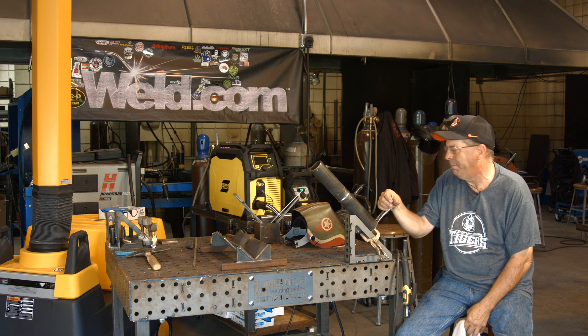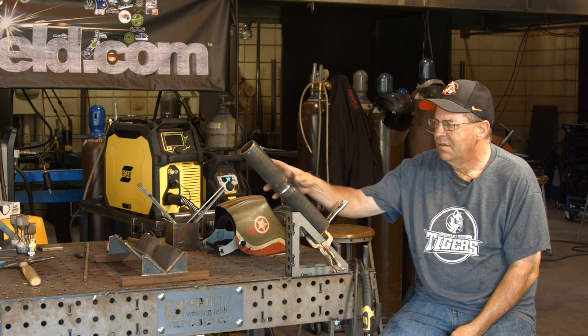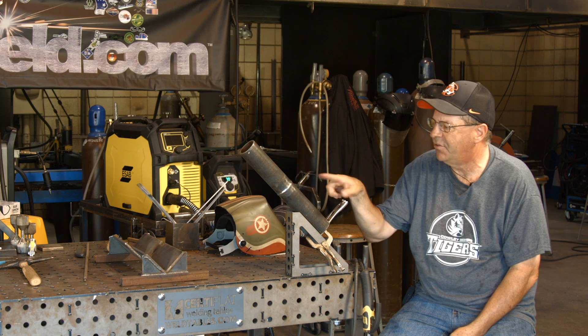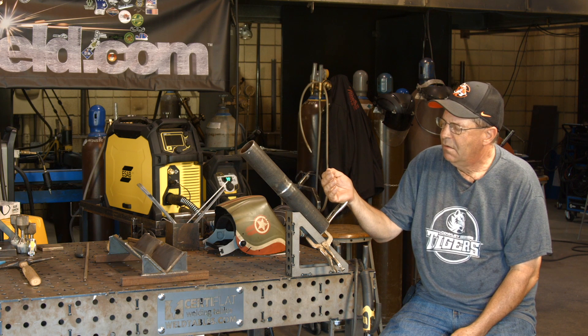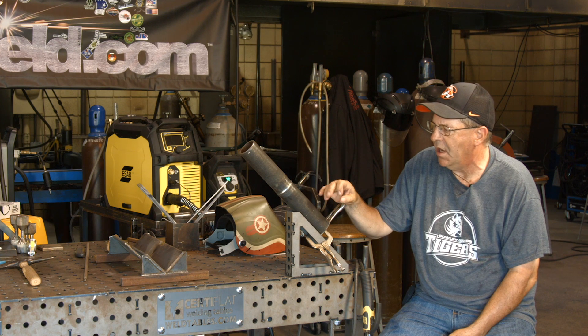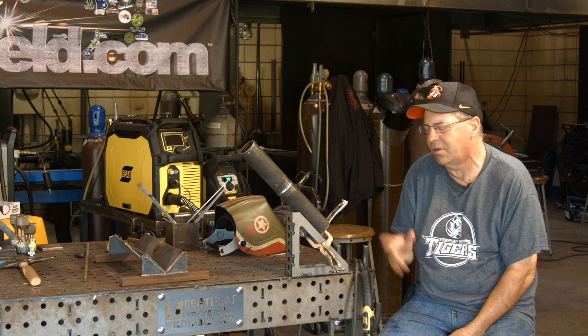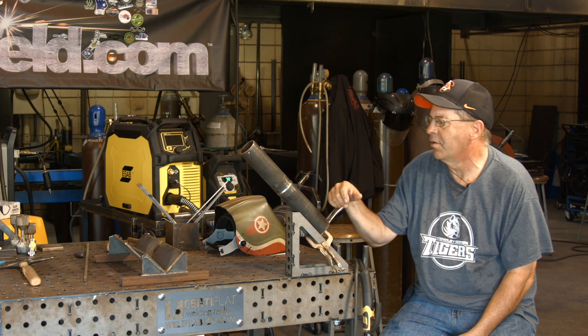On the cap, I just went straight to cap and turned it down to 70 amps. You may think that's a little low, but 70 amps on 3/32 7018 — this part is saturating with heat quickly. If I had a little bit fuller fill I probably could have gotten away with a single bead. However, I had a little bit to fill, so I opted to go 70 amps and do two stringer beads for the cap.